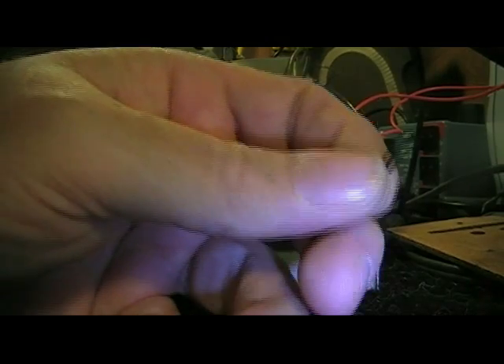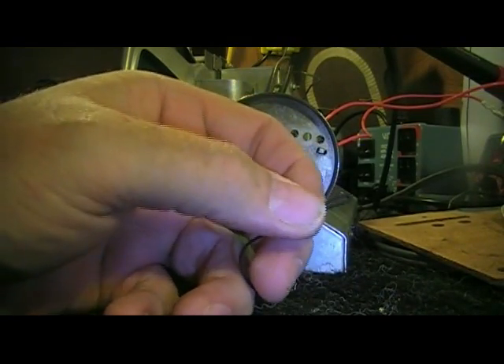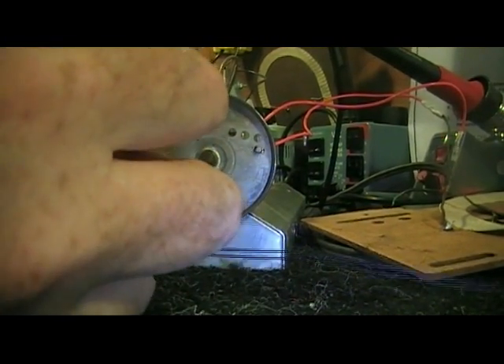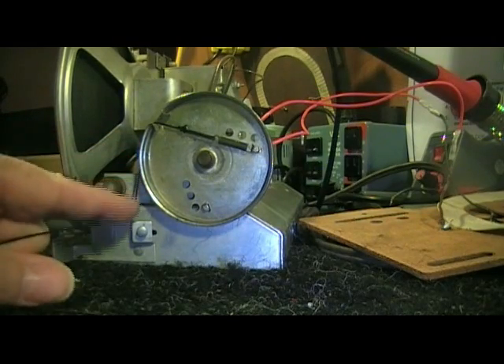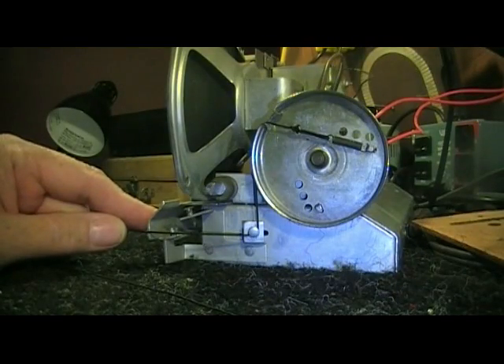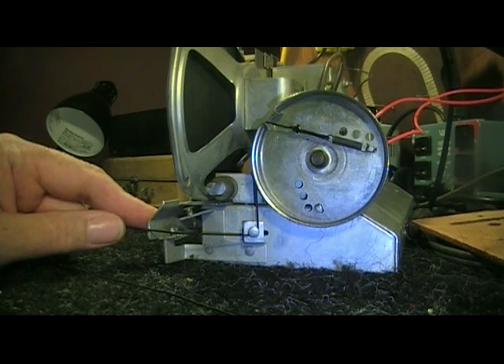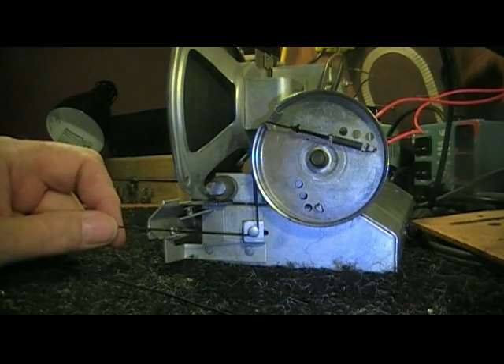What we're going to do is hook this up to the spring, hook the spring up to the large wheel, and run this cord through the whole system and then bring it back to the wheel and back to its final resting position. What that will do is give us an exact length of what we need this cord to be, and I'm going to mark that length with a piece of masking tape. I hook up the spring and run it through the notch on the wheel — the gang is fully closed as suggested in the schematic. I run it through the first pin, through the second pin. Eventually it's going to go across the front of the radio. You can see this canal right here, this little crevice — the cord is going to have to go through there to the other side of the dial to where it connects with the wheel. It will go around the wheel, come back to this point, and go around the tuning control knob and then the large wheel back to the spring.